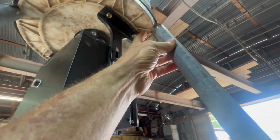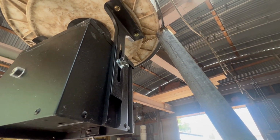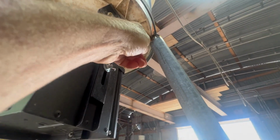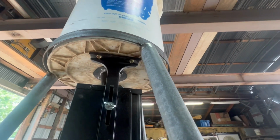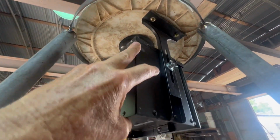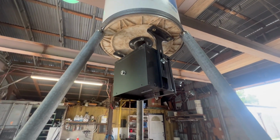Now the bucket is sitting on the end of the pipe, and it's not going to go anywhere. But my problem is I don't have much of a weld at all between the pipe and the ring. So I want to put a little flat plate up in there, so the bucket will sit on it, and it will give me more weld. And the exact same thing on the outside. I want to put a flat plate to give me some more weld. And from there, I'm gonna put some verticals to keep the bucket from falling over or getting knocked over. So I wanna get those 6 little flat plates done before I go, real quick.